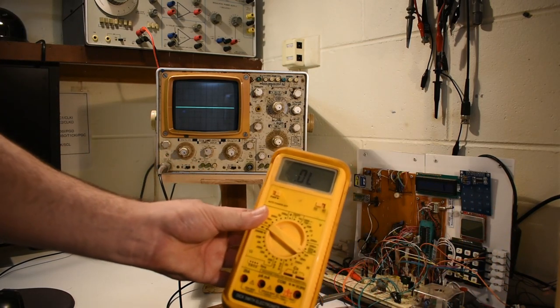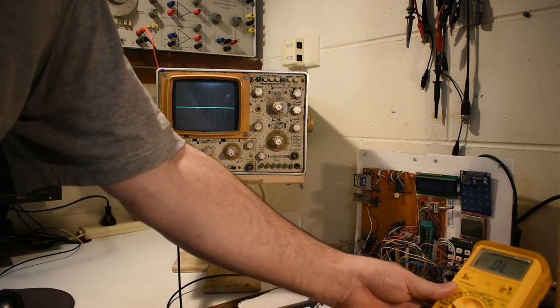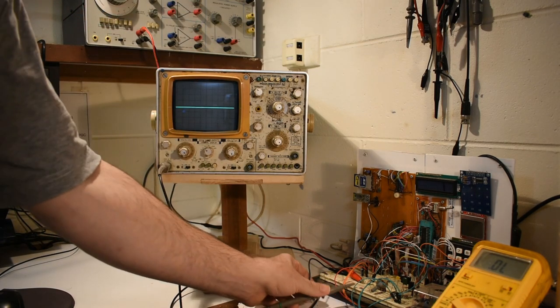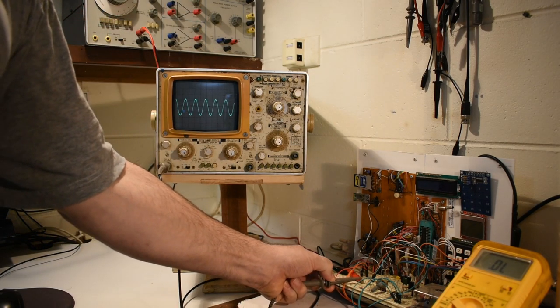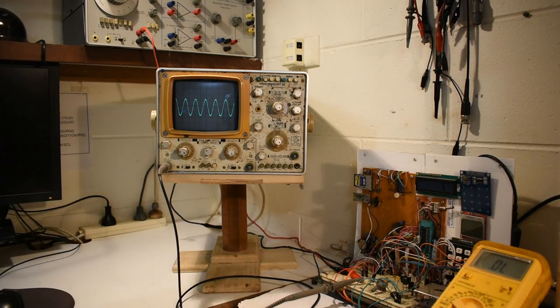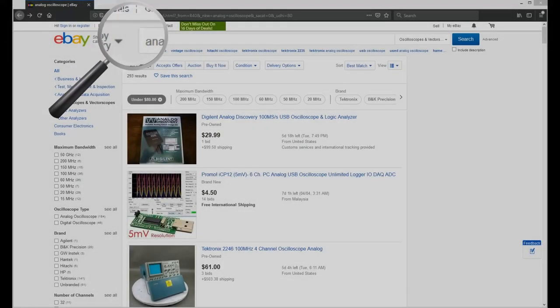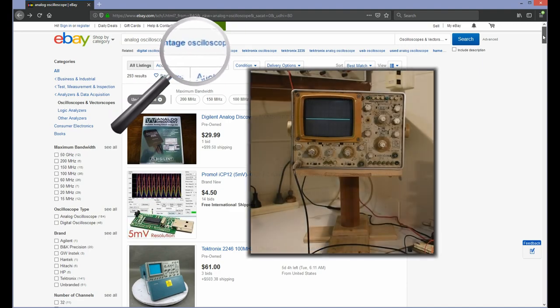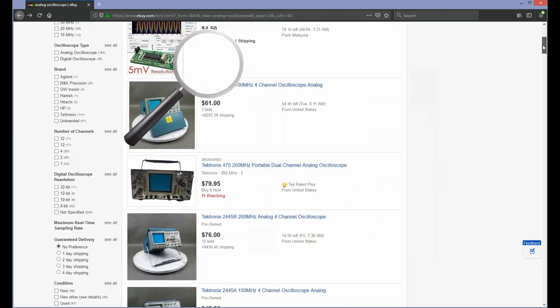Along with a multimeter, an oscilloscope, if not exactly essential, certainly makes many hobby electronic projects much easier during building and troubleshooting, being able to probe signal amplitude, frequency and form. Especially since old analog oscilloscopes are widely and cheaply available. For example, I got my 2-channel 50 MHz unit for $40 on eBay.